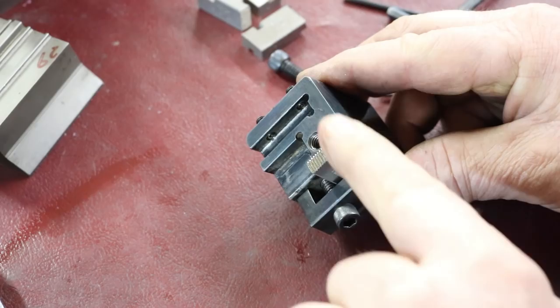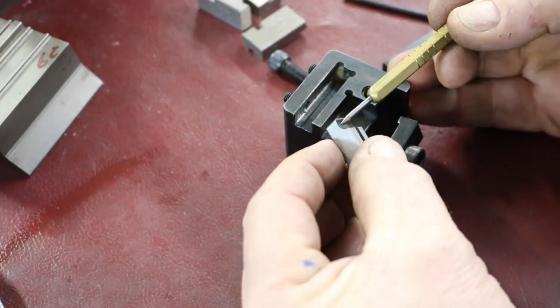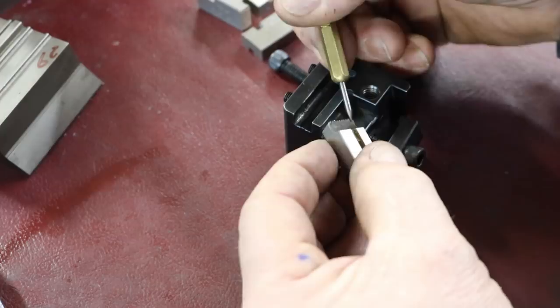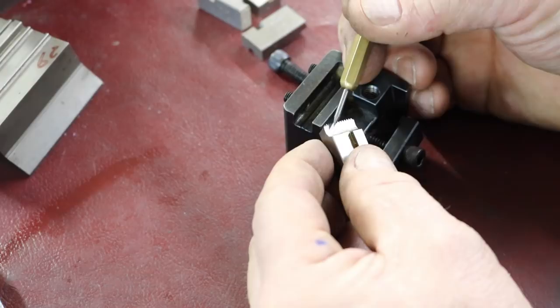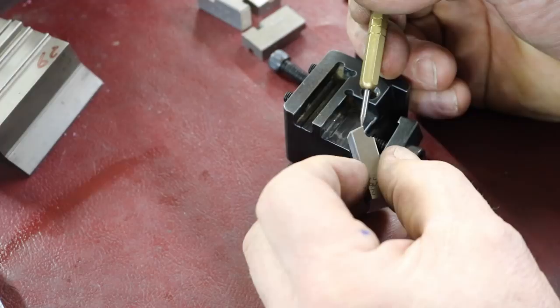Now, the third grind you'd make, if you really, really need to, right here, this face, there's a radius here, but this is all blended. This is actually flat right in here. This face is called the cutting face, and this extends when it's in the die head a little tiny bit past center. There's not much room here to grind this. It can be ground, but you don't want to get it past where it contacts past center, because this is kind of a tangential cutting action.